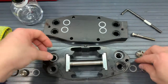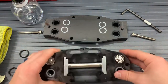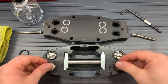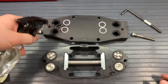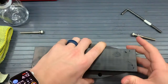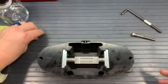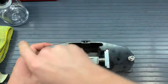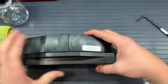Grab our manifold and put it near the pump heads. Place four white washers in the valve pockets on the heads, then put our valves in — orientation is important. We want our X's on top, nearest the sticker and H channel, and our O's below that, so X's across from each other and O's across from each other. Next place the 116 O-rings — one around each valve. Take our four remaining white washers, spray or dab the valve pockets on the manifold with water and slide those white washers into place so they don't get dislodged when we flip the manifold over. Flip the whole thing over, double-check that everything is the right distance apart so our seals are correct, and put the bolts and stainless steel washers onto the heads to secure them to the manifold. Flip it on its side to confirm the sticker and H channel are in the right spot — looking into the ports, you should be able to see the valve X facing out on the sticker and H channel side.